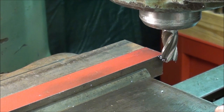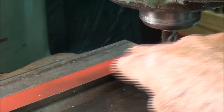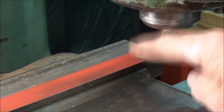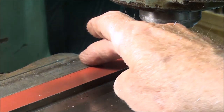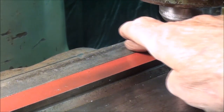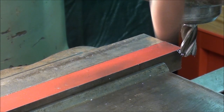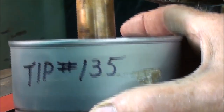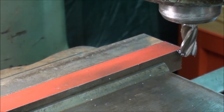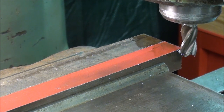I'll also do a little bit of drilling on two different kinds of material. The purple or reddish piece is Ledloy, or 12L14 screw machine stock — available in round, hex, and square. The other piece marked 'David' was given to me, and I believe it's just cold rolled steel. I'm using a sharp half-inch end mill, one hundred thousandths deep at about a thousand RPM, with a little oil.